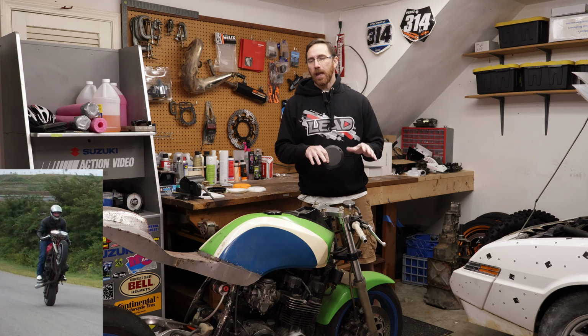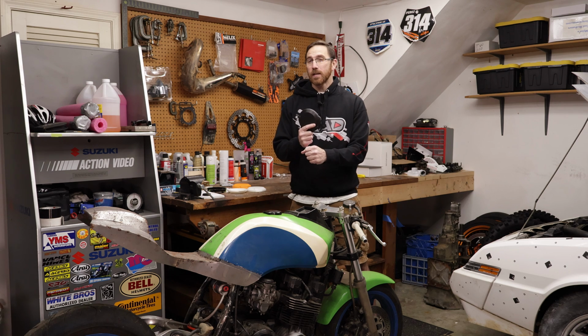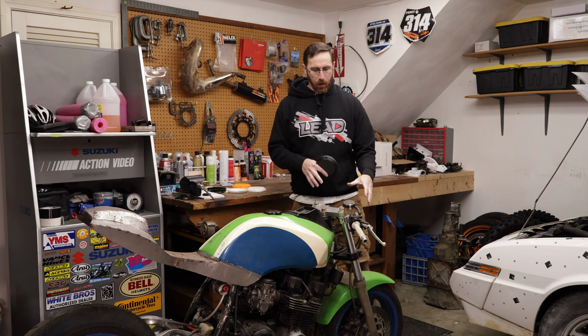So this bike has an 89 GSXR 750 front end. This is what's called a conventional fork because the portion that's clamped into the triple clamps is stationary and it's the inside of the tube, and the bottom portions are larger. Most bikes now have upside down forks where the larger portion is thicker, and it basically adds more rigidity. However, if you know anything about these bikes, back in the 80s, they were called the Flexi Flyers because the chassis actually twists quite a bit.